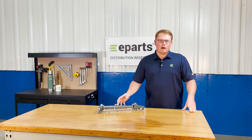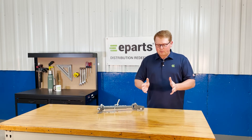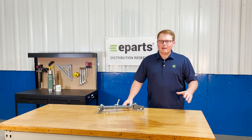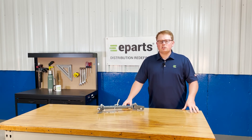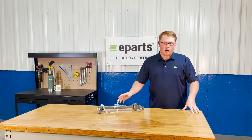In addition to that, on some models if you have the R4 tires, when the implement is out at its widest it's going to be close to rubbing those tires, so you might need wheel spacers. We show a picture of that in the product description, so please take a look at that and consider that when purchasing — it may be required for your model.